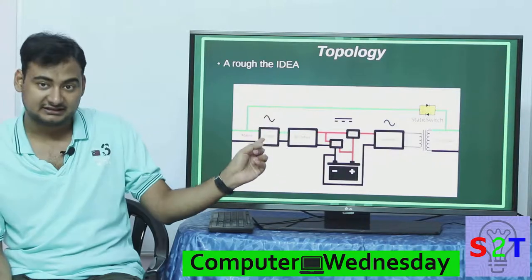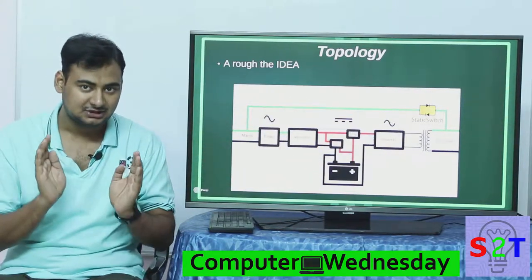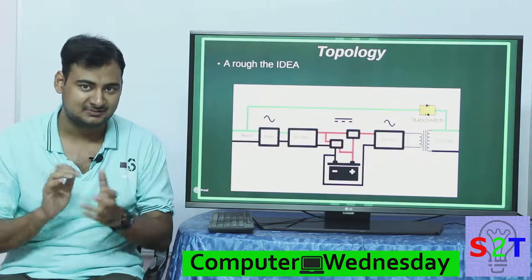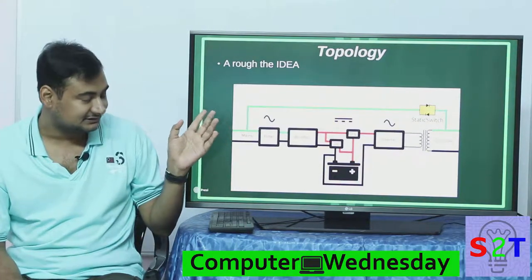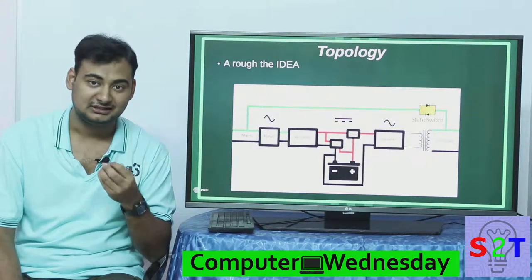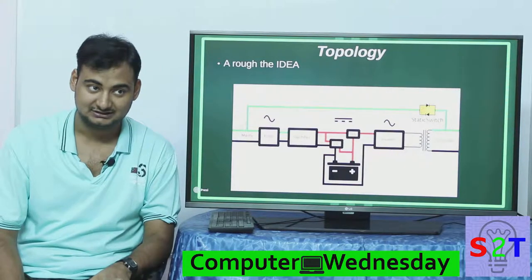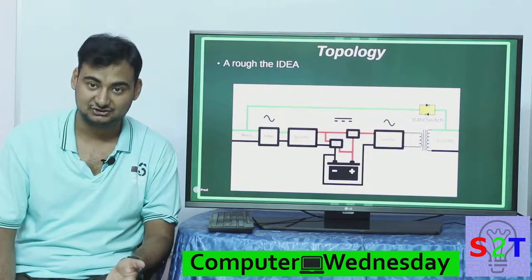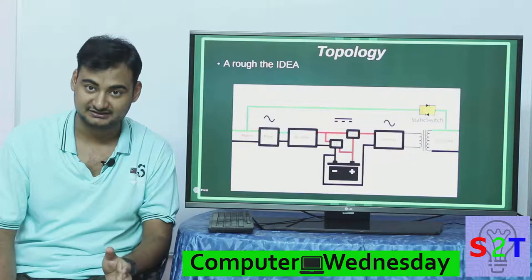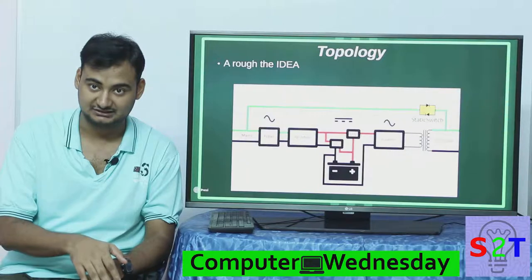The rectifier output goes to what I call the DG — diode gate. This is kind of the top secret or patent part of all the systems. This is where the switch is in online UPS. When people say online UPS is always running on battery, no — that's practically impossible because batteries are not capacitors. Because of their nature, you have to separate them while charging and discharging.